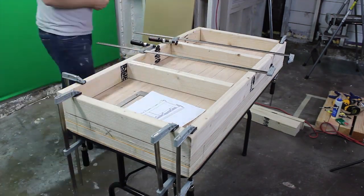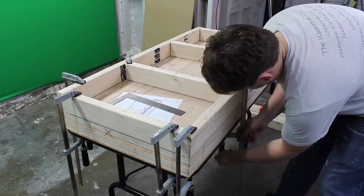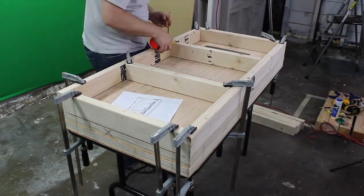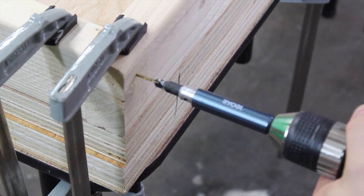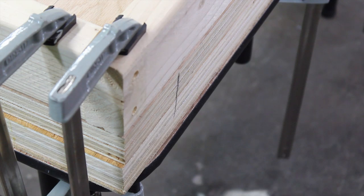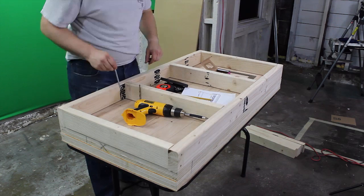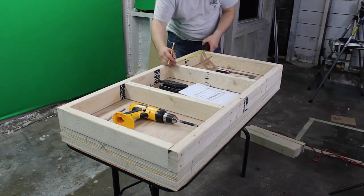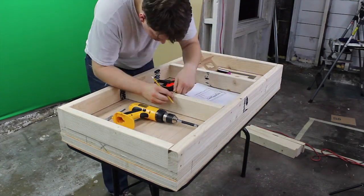Go around every single one of these corners and check them. I got all these clamps on Amazon — it was a 30-pack of bar clamps for $120 at the time, I'll put a link below. It's critically important that you countersink each of the screws going into the butt joint for the edge of the frame, because otherwise you will split the 2x4, which is bad. Now, in order to secure the 2x4 frame to the top, I decided to use 6-inch lag bolts, because the 2x4s are 3.5 inches wide.